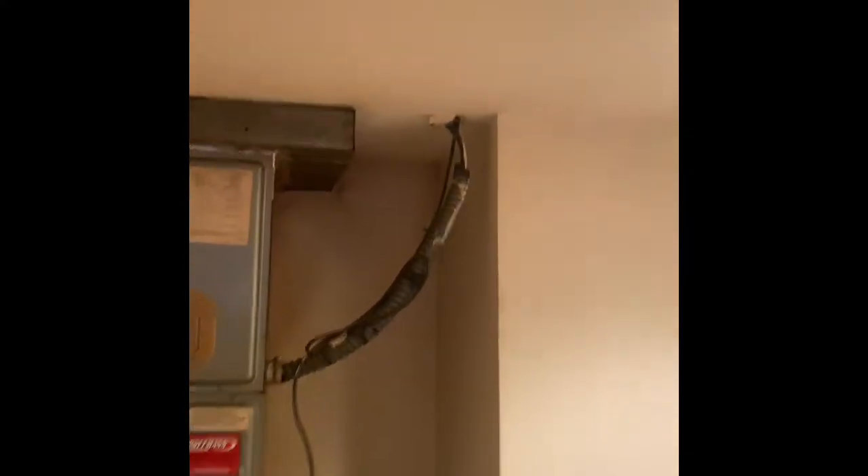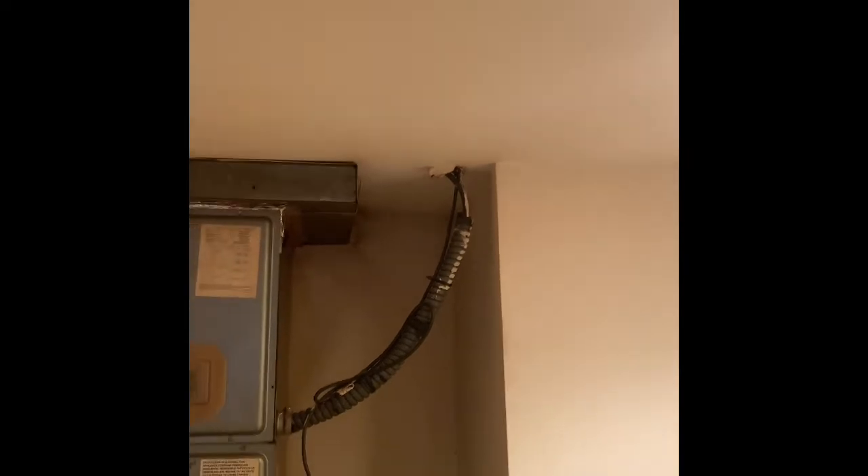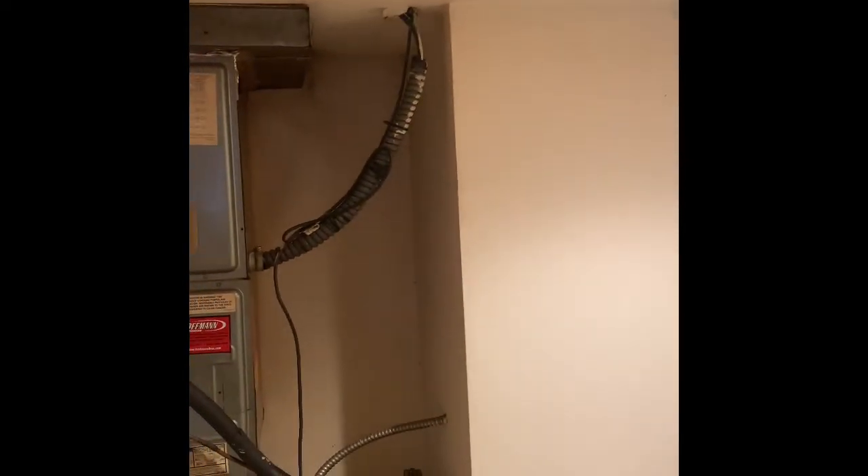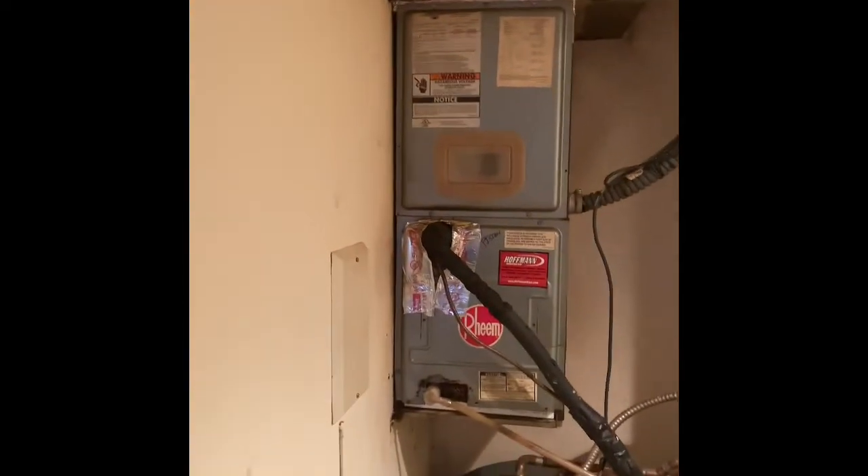Electrical will have to get reworked. It goes up into the ceiling there with the conduit just falling apart. The breaker panel is right here — there's the Sylvania load center. We have a 2-pole 60 amp breaker for the air handler and a 2-pole 20 amp breaker for the air conditioner. And that's it.